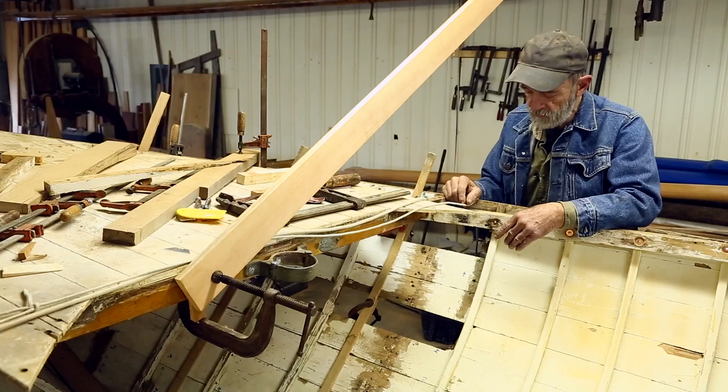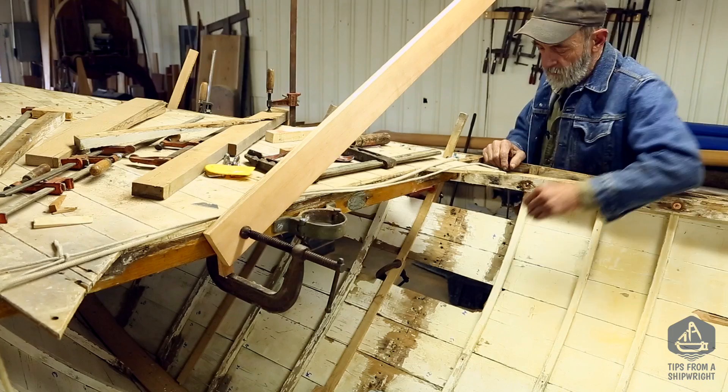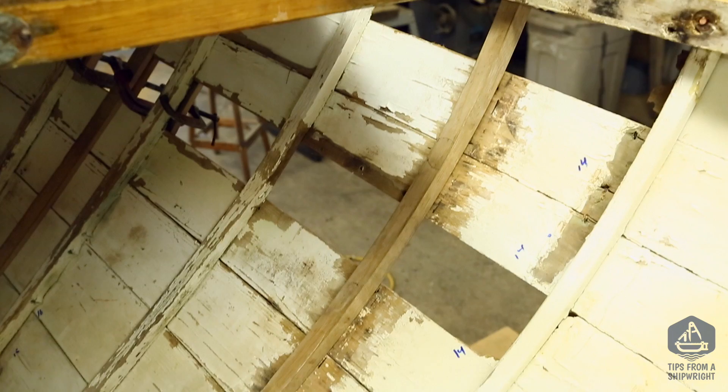I'm at the starboard side of this little 12 and a half at the forward bulkhead, and this is going to be the first frame that we're going to replace in the boat. Most of the framing from here back has already been replaced. These frames are actually square edge, so they're square frames put down there twisted into place. For the frame we're going to put in, we're going to saw it to a progressive bevel or a rolling bevel so that it will lay against the plank perfectly, and the after face of it will also lay against the bulkhead.